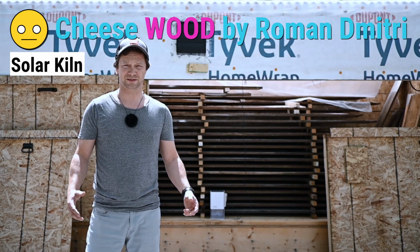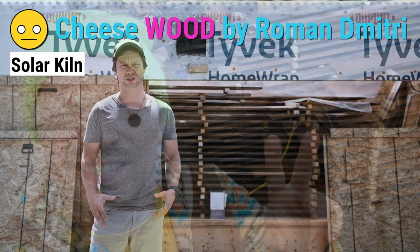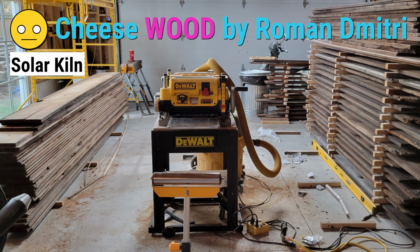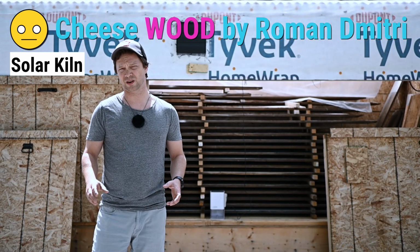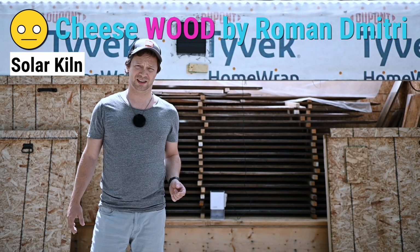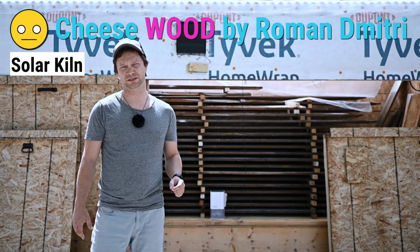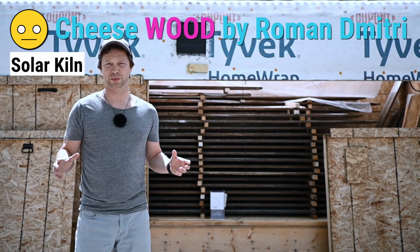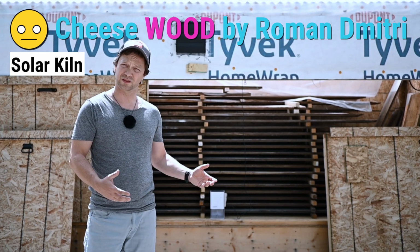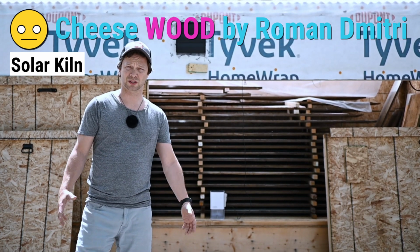Well, on the surface. We spent a lot of time cleaning, and when we thought the wood was ready to go and dry enough after just sitting in the sun for a while, we started planing it. We planed it down from just over an inch down to 7/8, and one out of 20 or so pieces had a couple of larvae in it. This made us panic, because if we found larvae, the borax didn't work, and there's a chance there's still larvae in other pieces of wood that we simply haven't seen yet. This meant that we had to do something.